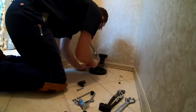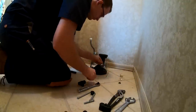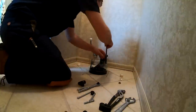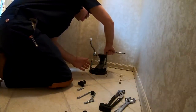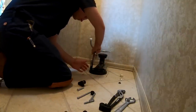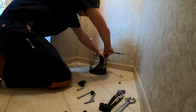This is the new Kohler toilet, and it's got a unique way of hooking into itself. So I'm putting all the fancy bolts down, making sure everything is snug and tight. Once you get those two bolts down, just like putting any toilet on, you're gonna want to snug those down really well to make sure that wax ring is really sealing. You won't really know if it's sealed until after you get the toilet installed and see whether it leaks or not — so doing your due diligence at this part is very important.